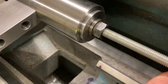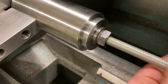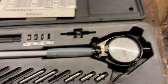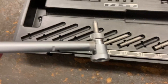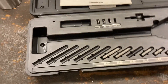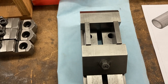The 1.997 gauge pin fits — goes all the way in — so we know we're getting pretty close to where we want to be. I took a 1.998 gauge pin on a makeshift handle to size the hole and see how close we're getting. I don't have ball mics. The 1.998 goes in but doesn't go all the way — and I don't want to force it and get it stuck. So we know we're about 1.998. The dial bore gauge responds pretty close to that.